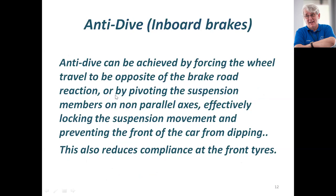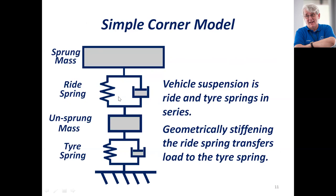If you stiffen that spring rate so that it has less compliance, then more of the load is actually going to be transferred to the tire spring, which can materially affect your road grip. There are people who will argue, probably rightly so, that putting more weight on the front tires actually increases the grip, and that may be so on a nice smooth surface.